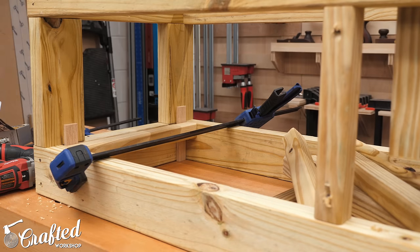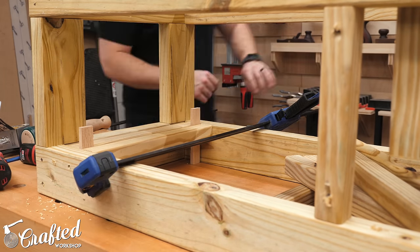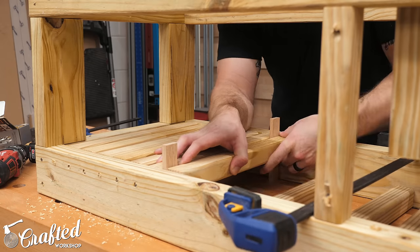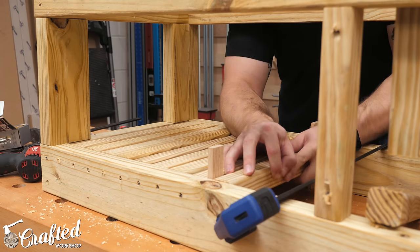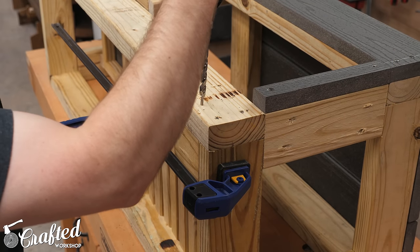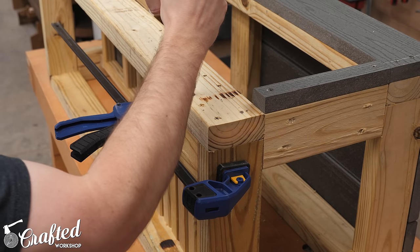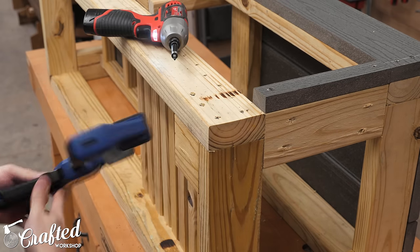The back of the patio cooler was going to have an open area, so I figured it'd make for a perfect shelf for storing little odds and ends. I cut some more 2x2 pieces to fit the opening and attached them with a screw from each end, using a couple pieces of scraps to space the pieces about a quarter of an inch from each other. The last pieces to add to the frame were a few 2x4 pieces that would give some more area for the flanges on the metal base to attach to, and I added those to the inside of each corner using a few 2.5-inch screws.